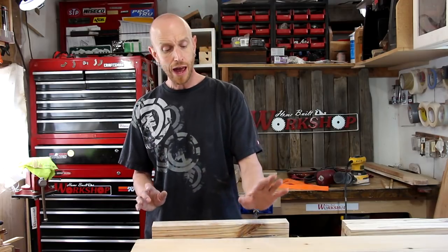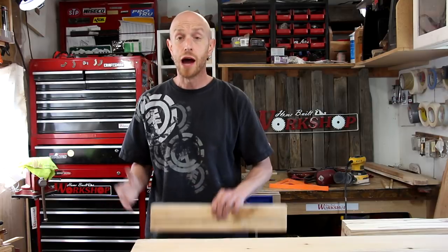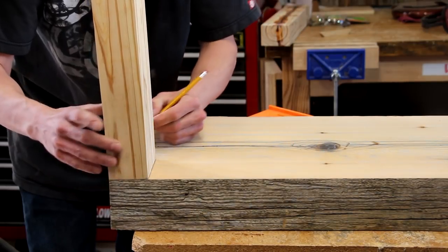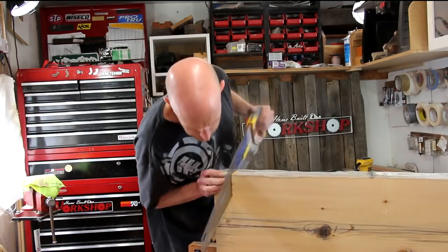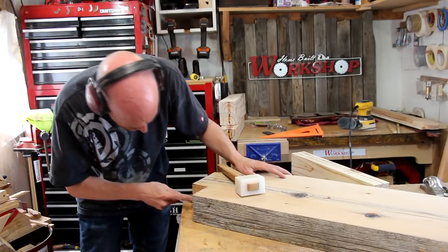Right now I have most of the sanding complete. I've got just a few spots where some bubbles formed in the epoxy that I need to touch up, but I'm gonna do that a little bit later. Right now I'm gonna mark out and cut the spots where the legs are gonna attach to the bench — I'll put the leg into place making sure it's flush with the edge of the bench and trace around the outside, then transfer those marks to the top of the bench and use a handsaw to remove that waste. This process turned out to be quite awkward and time consuming, but I repeated the same steps for all four corners, with extensive chisel work to get the joints squared up.